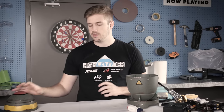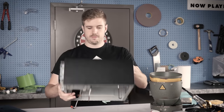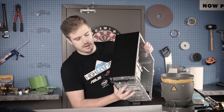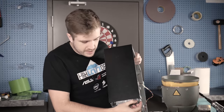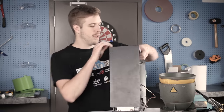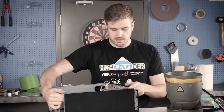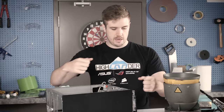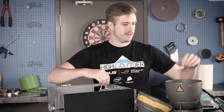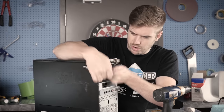I don't actually have another one of these spare switches. That's where this hunk of junk comes in. This guy up at the top has a very usable little tiny switch. So I'm going to drill the rivets out, rip this thing out, separate it from these wires, cut that off, tear it out, mount it into that plate, solder it into the thing, and then hopefully it works.